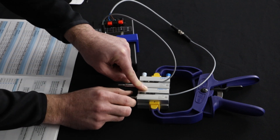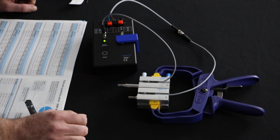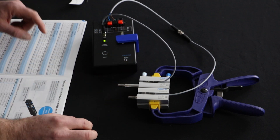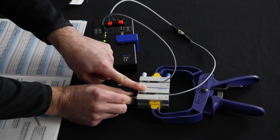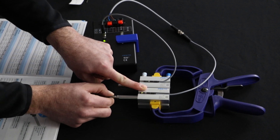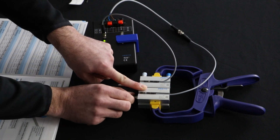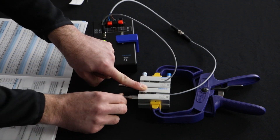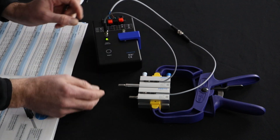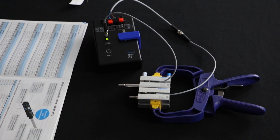That's awesome. So with the physical setup out of the way, will you show us how to teach the sensor? When it's received from the factory, it's going to be in its ready-to-learn state — it's ready to be taught. The way it behaves is after four consecutive strokes to the same position, you'll see that green light and the yellow, and now it's taught. Drop power, bring it back online, it's ready to go. Now it's been taught — it'll forever remember that spot, even through a loss of power like you just demonstrated.